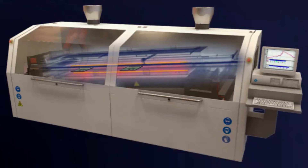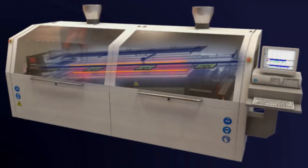Now that you have a basic understanding of what WPI does and how it works, let us review some of the key capabilities of the WPI. The system's embedded sensors across your wave machine will enable automatic measurement, recording, and displaying of a wide range of process-related details, including calculating a full virtual profile across the preheat and wave portion of the process. The WPI uses a combination of embedded temperature sensor readings with monitoring of the solder pot and conveyor speed to display a temperature profile for every board produced, eliminating the need for a periodic verification profile.